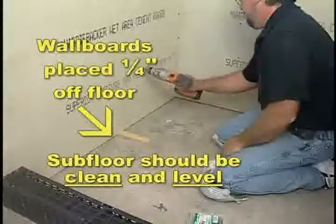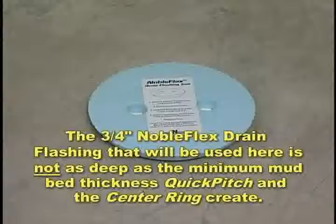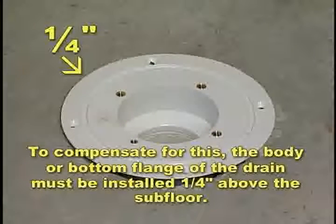Be sure that the subfloor is clean and level. The 3/4-inch Noble Flex drain flashing that will be used here is not as deep as the minimum mud bed thickness Quick Pitch and the center ring create. To compensate for this, the body or bottom flange of the drain must be installed 1/4 inch above the subfloor. This will guarantee that the Noble Flex drain flashing will lay flat on the drain body and the mud bed